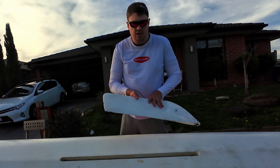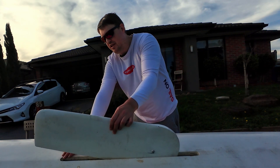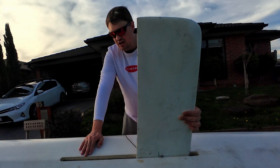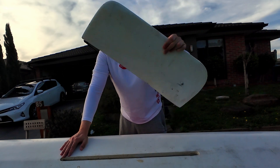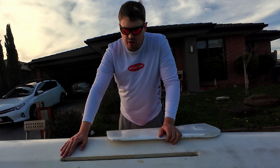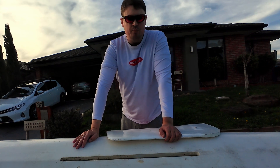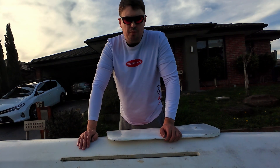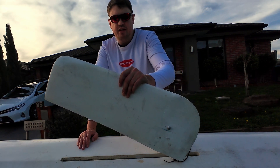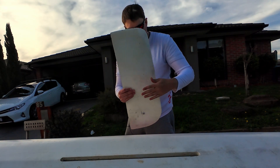This is obviously sitting at the front of the case and designed to swing up into this void. But there are no gaskets on this — not like a 420 or a 505 — so it's super draggy. As Homer Simpson says, 'crisitunity' — crisis opportunity. I thought, why bother repairing this old case when I could just cut the whole thing out and put in a vertical board? In the high performance sailing book Frank Bethwaite wrote when designing these boats, he said if you're going to have a foil, keep it vertical. To reduce area and go faster, I don't want to be kicking it back and having cross-span flow. I want to be able to retract it vertically and reduce area that way to maintain the flow straight across the foil.